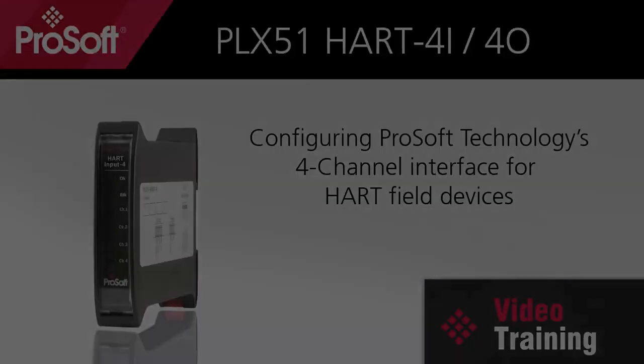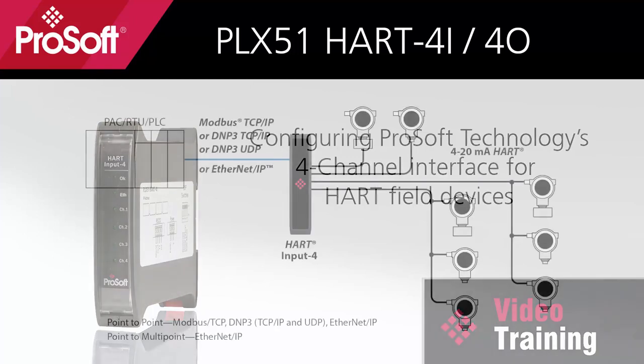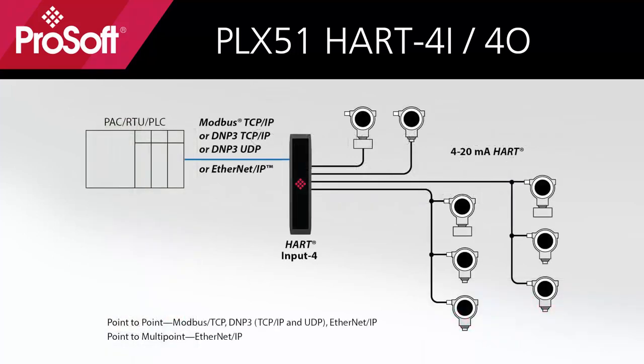Welcome. Today we'll be configuring a PLX51 HART-4i gateway, a 4-channel HART interface for HART field input devices to connect to a level sensor on a HART network. With this PLX51, you can convert up to 4 analog signals on a HART network to either EtherNet IP, Modbus TCP, or DNP3 TCP UDP.